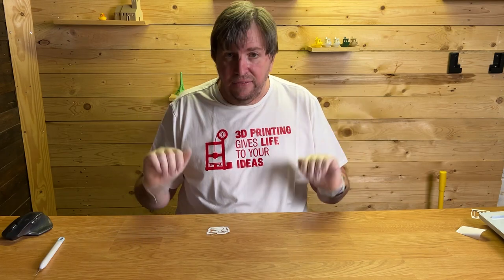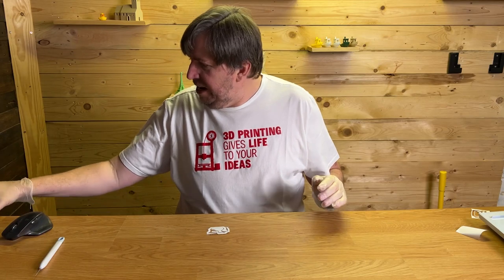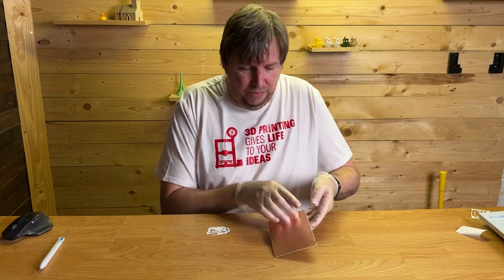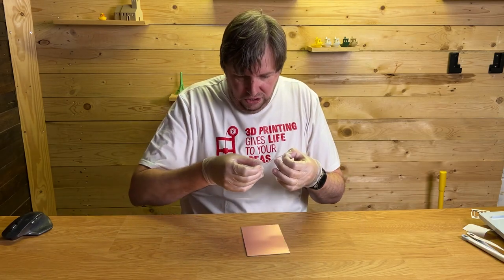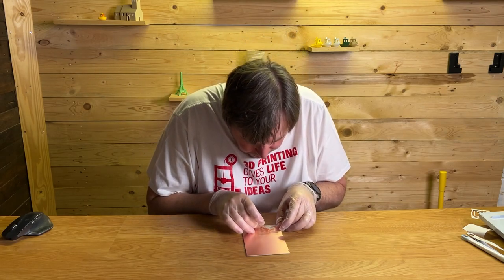I'm just going to do a bit of cleanup, put some gloves on, and then transfer this to the PC board. I've put gloves on because we're going to be using ferric chloride shortly in order to etch the PC board — this stuff does stain fingers and isn't too good for you. The other reason for the gloves is I've cleaned this board with a degreaser, really made it nice and clean, because fingerprints can impede the ferric chloride from doing the etching. As you can see, the holes are even there through the board, which is absolutely amazing.